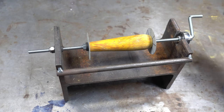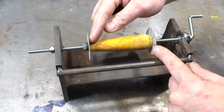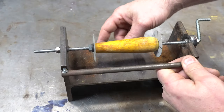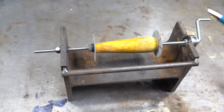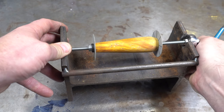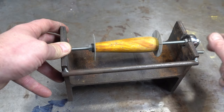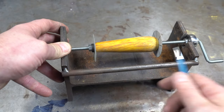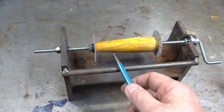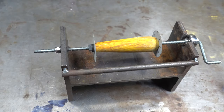The way this works is these dials have lines on them, and the same lines are on the other side. We take a pencil and draw a line across, spin it to the next one, draw a line, and repeat. Then hold the pencil and draw lines the other way — that gives us a grid system. Then we connect all the grid corners and that's how we get nice even spirals all the way around.